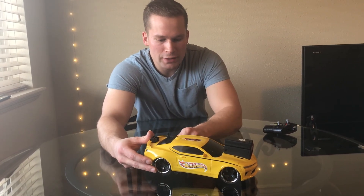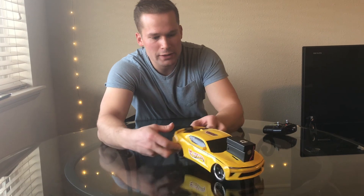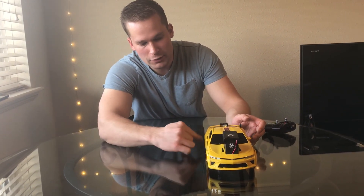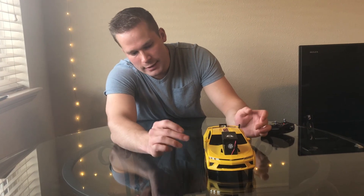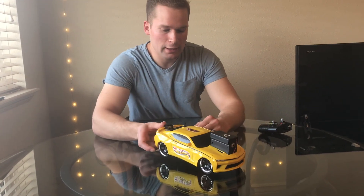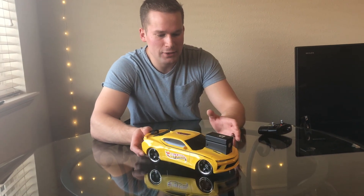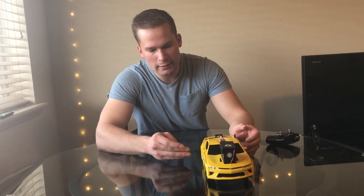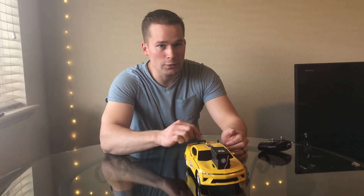There are two sensors in here — one sensor on one of the back wheels and one sensor on the front wheels. It's a Hall effect sensor, and it counts the rotations of the wheel based on two magnets on each wheel, so it counts every half rotation of both the front and rear wheels. If the rear wheels are spinning significantly faster than the front ones, it calculates the percent slippage and uses that to ramp down the pulse width modulation that it's sending to the H-bridge to control the throttle.